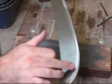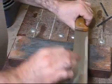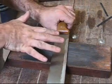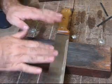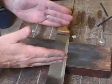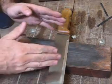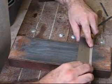The convex edge has enough steel backing it up to hold up to impact. The Scandi edge here does not. So if you're going to take the step of putting a Scandi edge down there and stropping it and making it a razor-sharp part of the blade, you have to be very protective of that part of the blade. Or you'll put nicks in it and roll the edge. Normally that edge won't take any impacts at all if you're being careful.